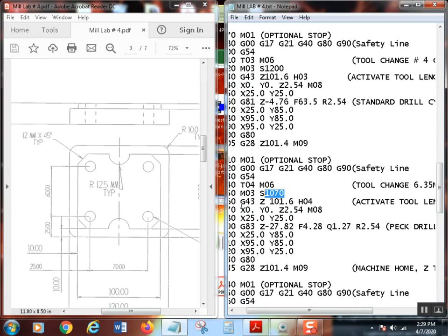Okay, so once I get that into position, again, I call my tool length offset, like always. Remember, the H number has to match the tool number. Very good. Okay, got that going. You can see there's that again. Get rid of that. A lot of controls may not give it a problem, but some controls, I can guarantee it will.